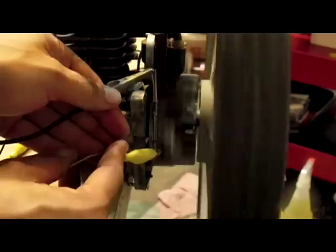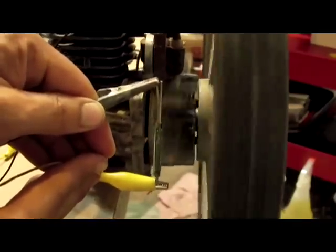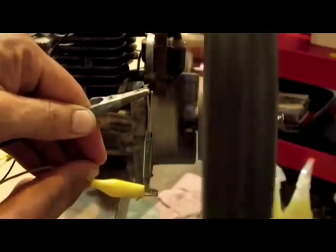And then, if we want to reverse it — the reason that this seems to give you more power is because this magnet on the innermost portion of the flywheel is traveling slower because the diameter is smaller in there. Whereas the magnet on the outermost portion of this bigger flywheel — basically a tire — is traveling a lot faster. This allows the solenoid valve to stay open longer. Whereas the inner position is a shorter run, giving it less air. The only reason they're reversed is because of their relationship to each other.